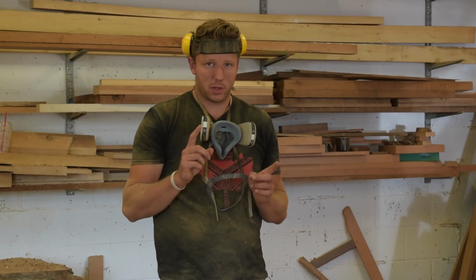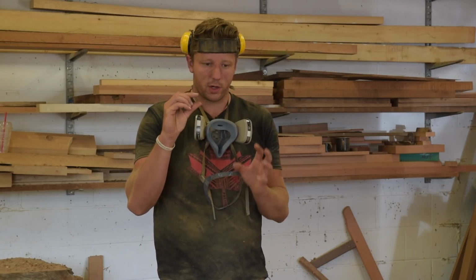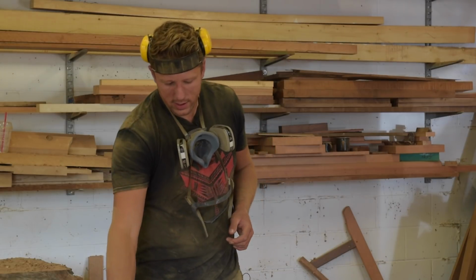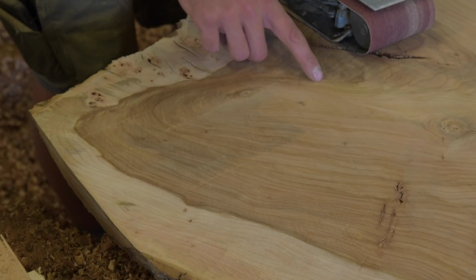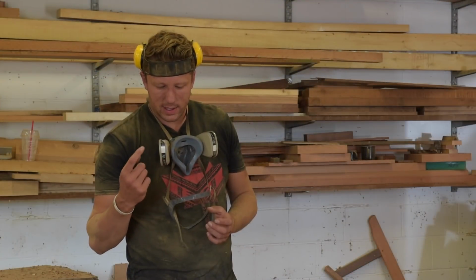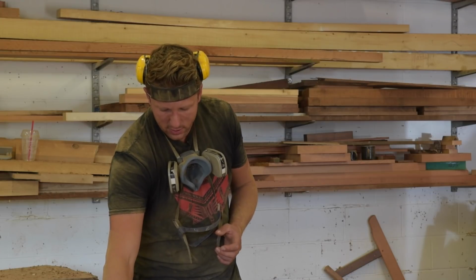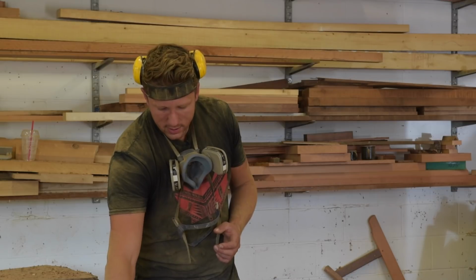The other negative thing between taking a 1/2 inch of material, you think it's quicker because you're doing twice as much material, but what I've noticed is on the wood here you can see I've got these little tear outs. What happened is the router was moving too much material at a time, it was tearing out, bogging down the blade, I guess, slowing the rotation down a little bit too much, and tearing out wood on the edge of the cut.